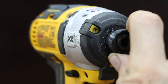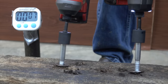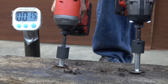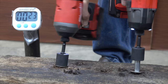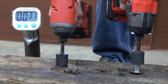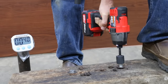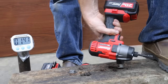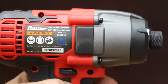According to the DeWalt app, the temperature of the impact driver was doing okay. Testing the Milwaukee on the left and the Bauer on the right, both in high-impact mode. The Milwaukee was a lot faster than the Bauer, but the Bauer was making pretty good progress. The Milwaukee finished first, but then started shutting off, requiring trigger releases to restart. The Bauer continued to hammer away but was slowing considerably. At a minute and a half, the Bauer was smoking badly and no longer making progress. The temperature of the Bauer reached about 300 degrees Fahrenheit. The Bauer failed — only one of three lights was still working and the rest of the impact driver had stopped functioning.